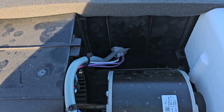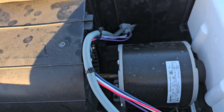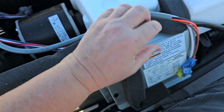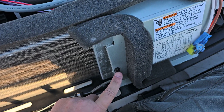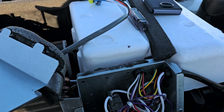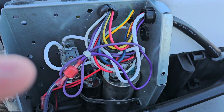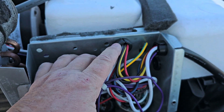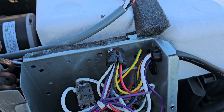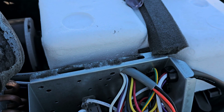I have all the putty pushed back around where I pushed the wire through, and then I zip-tied the cable, and now it's going to come in around through this panel. I'm going to use a 5/16ths nut driver head to take these two screws off and pull this panel back. I've peeled the panel back to expose what we're going to be working on. The first thing I have to do is remove this grommet and get this cable brought through this hole. I used a pair of needle-nose pliers and a flathead screwdriver to pry and pull to get this out.